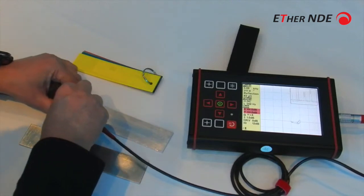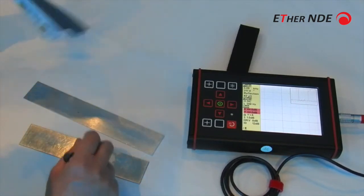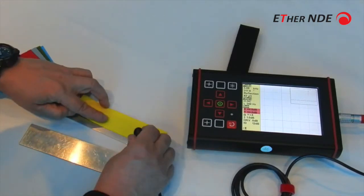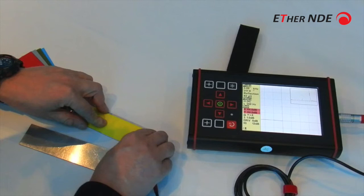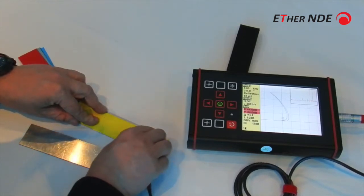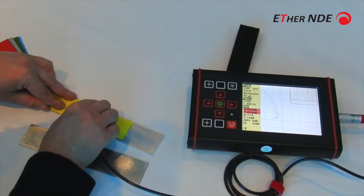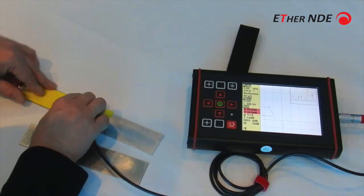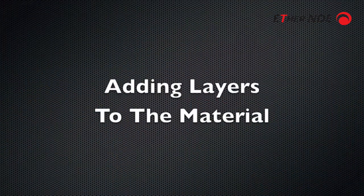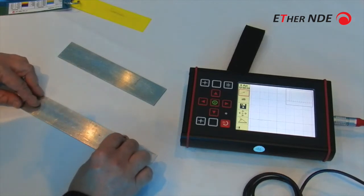That's at 5 kHz — that's on the back face there. Now one of the things about this, of course, is using paint coating. Press balance — liftoff still good. We can still detect the defects. So you can see even the small one is still there.